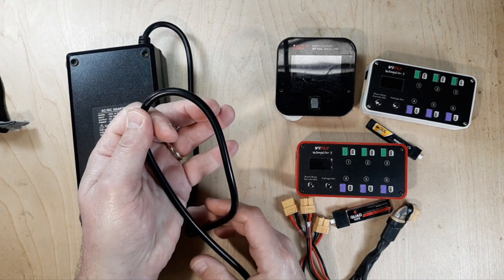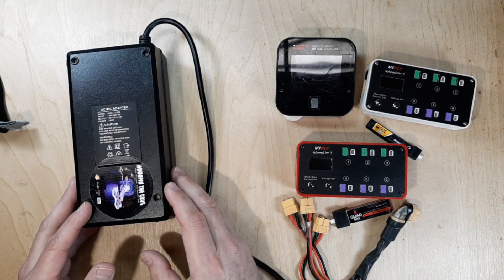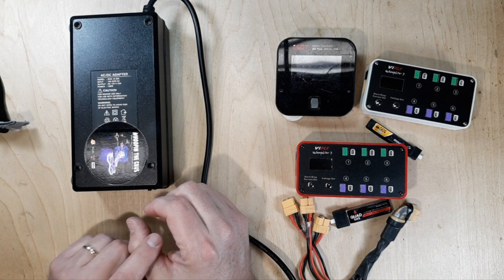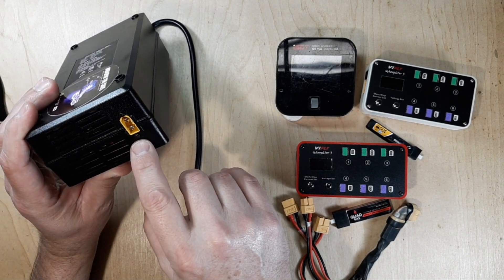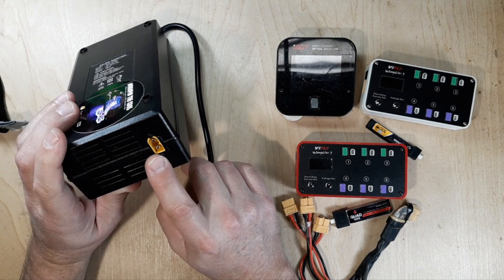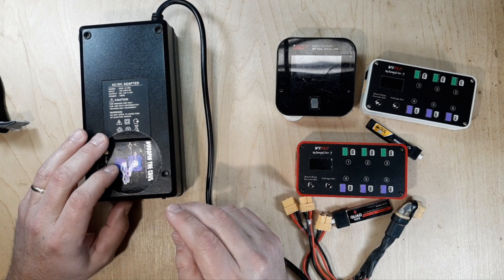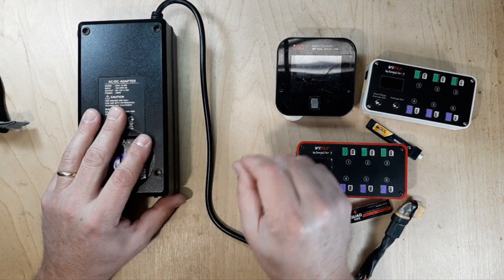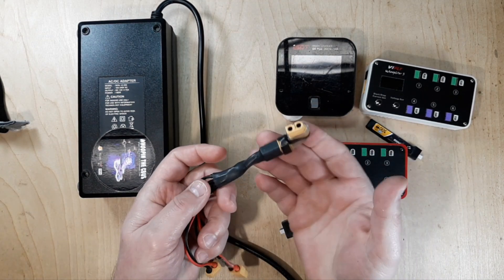The cord is about 10 feet long, which is great when you're at races or you've got an outlet next to a picnic table. Normally there's a cord that comes out with a cigarette lighter end on it, but I cut that. I actually opened this up and soldered an XT60 to it right here. I like that because it's sleek and fits in the bag easily. In hindsight, it would be easy to just snip off the cigarette lighter portion, solder an XT60 onto it, add some shrink tubing and strain relief, and have a whip coming out with an XT60 on the end.